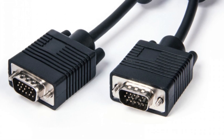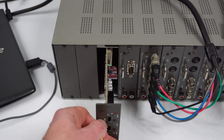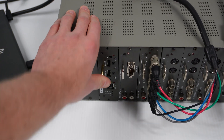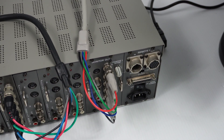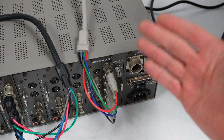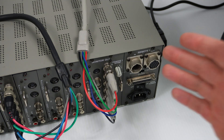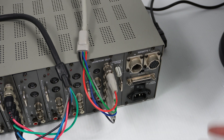To test this theory, I'm going to use the Sony signal interface switcher, the PC-1271. The reason I'm plugging the card into the switcher is that I want to see what signal this card outputs. The switcher only outputs analog signals — it has S-Video, Composite, RGB-S, and RGB-HV outputs. There's also a remote output whose pin-out I've read, consisting of analog signals with a few other things, but certainly nothing HDMI compatible.